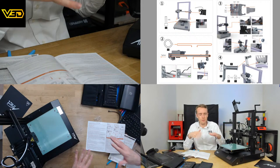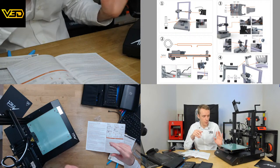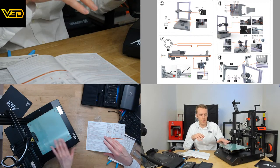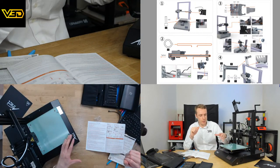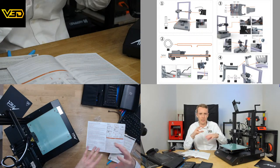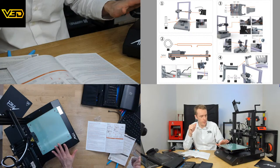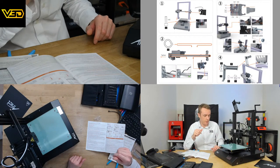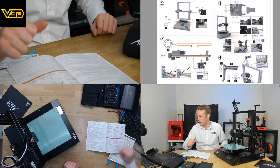Easily my preferred way. Glass, it's nice that it's really flat. Typically, it's really flat. And I think that's why it's quite often used, certainly why I used to use it in the past. The aluminium beds that are low cost tend to be a bit warped and wobbly. So if you want to print a decent area on there, you need something that's flatter, because otherwise you can't physically level a bed that's all over the place unless you start going like mesh bed leveling sort of thing, which is not really leveling. It's more just like a bodge to get around it. But yeah. Although it is very flat, obviously you can't flex it to get prints off. So you end up attacking it with a spatula or waiting ages and ages for it to cool. So not perfect.